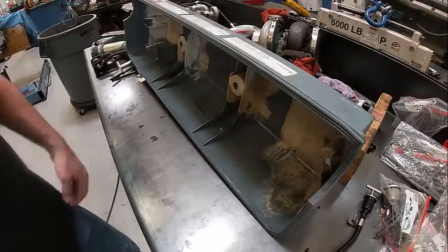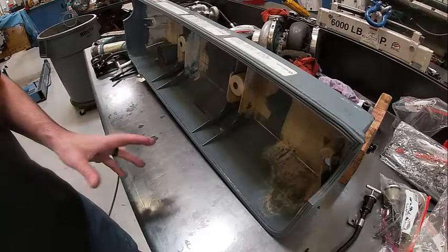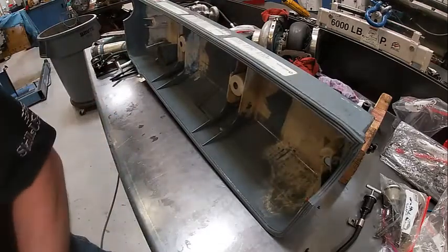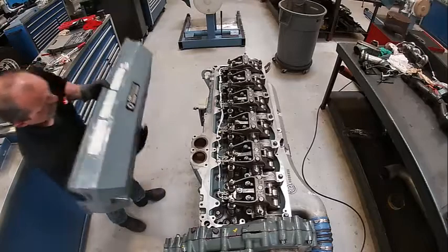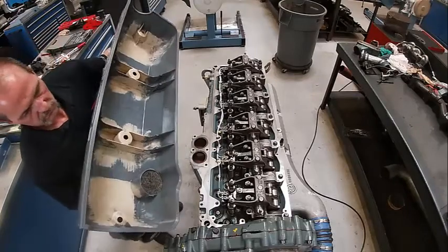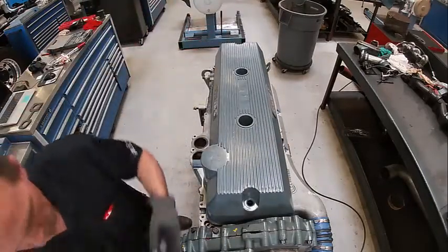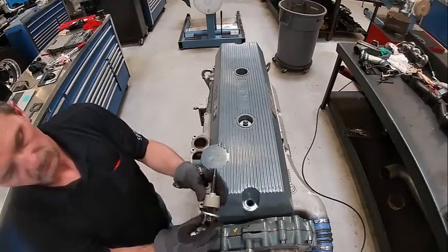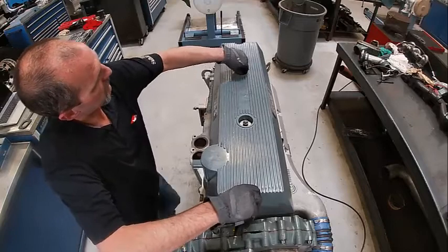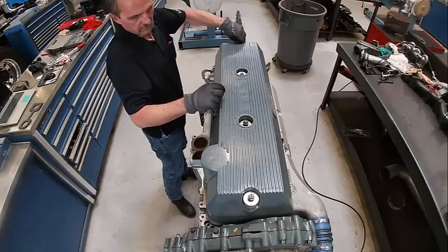If you have to replace this gasket, it's a reusable gasket. They're kind of a pain to put in - you need to run it through a hot water washer and make sure it's completely clean and dry before you put it on, otherwise the gasket won't stay. The newer style valve covers don't do that. Make sure the gasket's in the groove. I put goo in the corners. There are four bolts down the center with big rubber isolators. This is a jake brake valve cover.